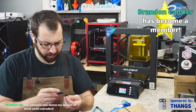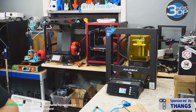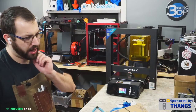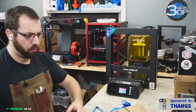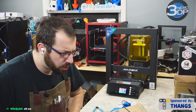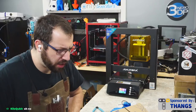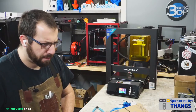Any suggestion for filament runout on 2.4? There's a few. You can really mount it anywhere. I wouldn't recommend mounting it in the tool head, simply for the fact with Klipper, because everything is batched commands, you do want a little bit of a gap. You need time for it to sense it ran out and then stop the print.